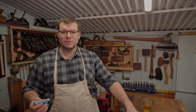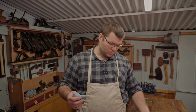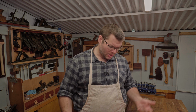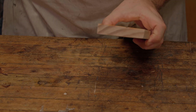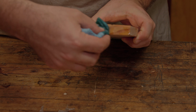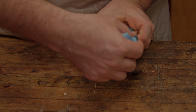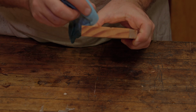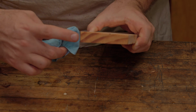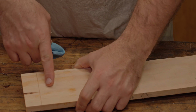Now, if that absorbs and it still looks a little bit dry in a few spots and it's sort of uneven, you know what I mean, it kind of comes out a little bit splotchy sometimes. I apply more oil to those areas. And I just want to show you what happens when we apply it to end grain as well. So if we apply this to end grain, and this is the only finish that really has a problem on end grain, it can soak in extremely fast on the end grain, so it may require more coats on the end grain faster than it will here.